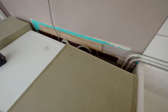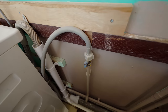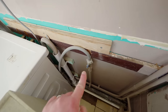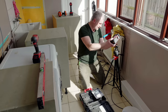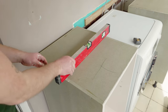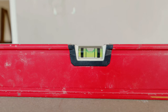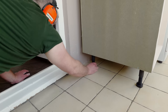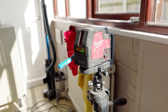The first minor problem is that where the washing machine is plumbed in is going to sit behind the cabinet, so to get around that I'm going to have to cut a hole in the back of the cabinet. Before I do that though I'm first going to set up a laser level so that I can get all of the cabinets sitting at the height that I want them at. I also need to get the cabinets sitting level by adjusting the height of the legs, and I want that laser level to just be touching the top of each cabinet all the way across.